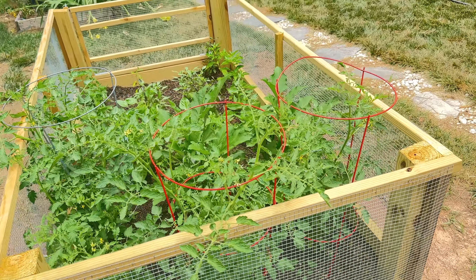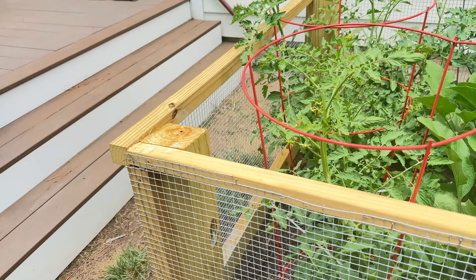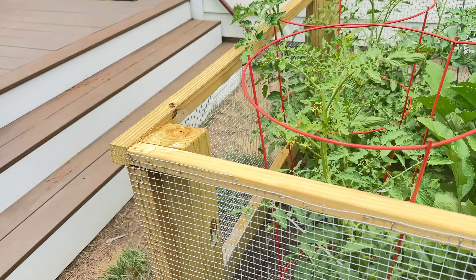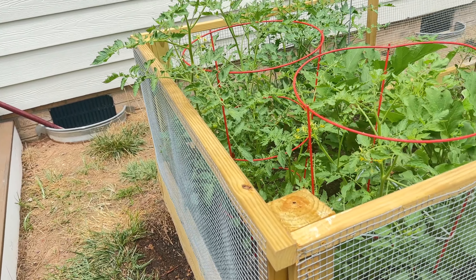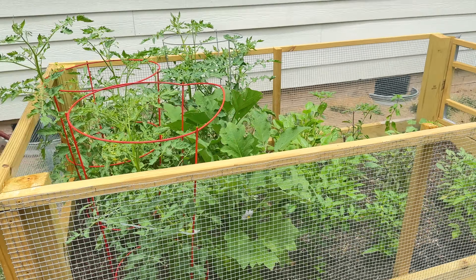For materials, you're going to need six eight-foot 2x6s that are treated — those make up your bottom frame. You'll need four 4x4 posts; I got mine in six-foot and cut them down. How deep you bury them depends on where you live. Down here in the south we only need 12 inches to get below the frost line, but I always go two feet. In Illinois you need 36 inches, in northern Maine 60 inches — so do a search to figure out your frost line depth.